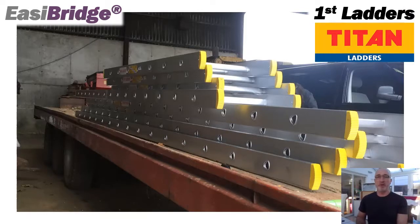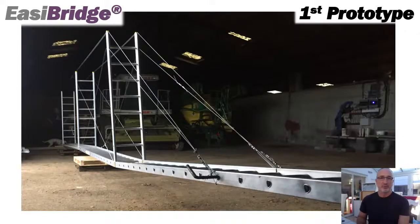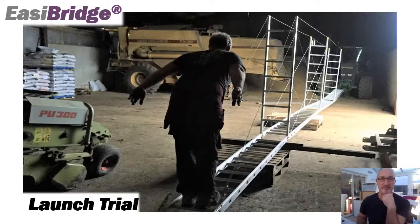Going back to the early history, we started by buying some ladders just to do some experimentation and see where we could go. We started with off-the-shelf builders' ladders — a very particular type of ladder; we wouldn't expect other ladders to perform anything like as well as this particular model. We then looked at tensioning it — very crude and basic, using two and four millimetre steel wire, wooden connectors, and very crude tension anchors at the end of the bridge. What we were really interested in was: could we launch the bridge as envisaged, could we counterbalance it, would it be a stable cantilever? This trial really did show great promise — an awful lot of bending in the ladders but it worked very well.